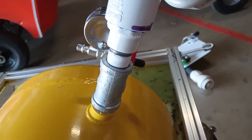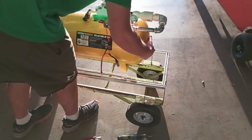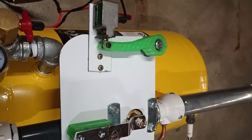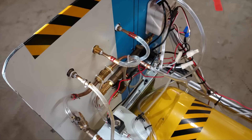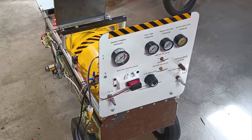Now that my nozzle was of a correct design, it was time to integrate the accumulator into the test stand along with all the additional fuel plumbing and control hardware for a hot fire test. I placed the tank onto my mobile test stand — which formerly held an earlier failed attempt at a rotating detonation engine — and changed out the spring valve with a giant servo valve for easy resetting and throttle control. I routed the pre-ignition system to a control panel and programmed an Arduino controller for main fuel, air, and ignition control, then rerouted all the plumbing and added gauges displaying important pressure information.